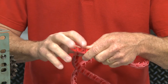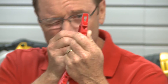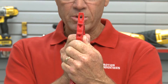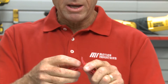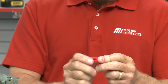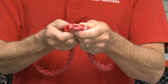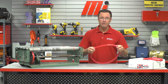It's kind of like a twist, and then boom — I'm good right there. Now I'm going to finish this last little slot. It almost looks like a rifle sight. I've got this tab and this slot — you can see it's kind of in a chair position, like a small chair. I want to take this slot and put this tab in there, just by turning it a little bit. You can turn it either way, lead it with that end, and then you can see how that pops through, and you work it through a little bit. And so it's in like such, and now I've got my belt — it's ready to install on my conveyor. It's that simple.